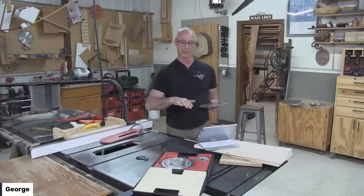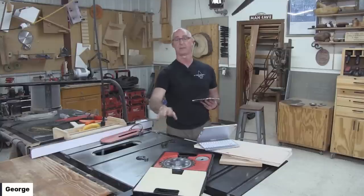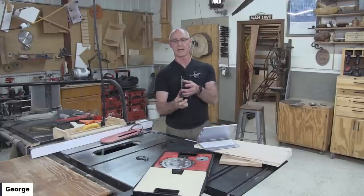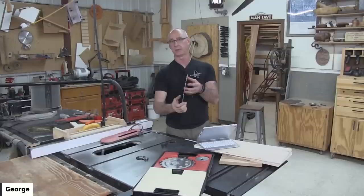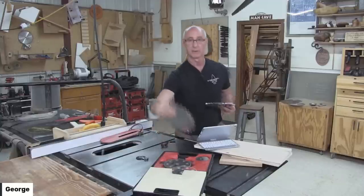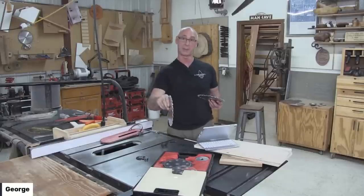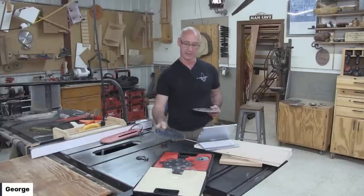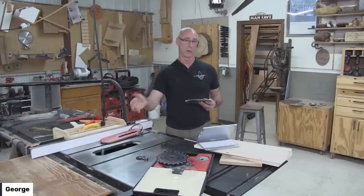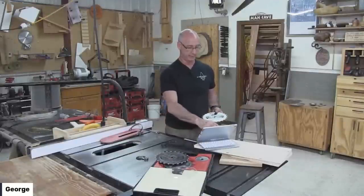Part of what's important with that is if I only get this retoothed, you should send the entire set. This also has to do with sharpening your dado, because once that new tooth is on, they've got to grind everything to match. And you want this blade and this blade to be ground exactly the same, meaning their diameter, and the chippers that are the internal blades in this kit. So send it in to get retoothed. And like I said, even if it's only one of the rim blades, two of the rim blades, send the whole kit, and they should then match grind everything.